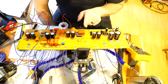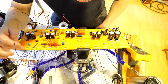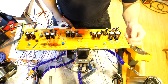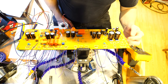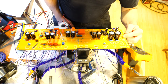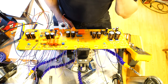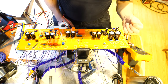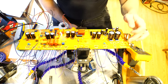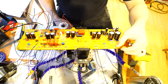This is going to connect to connections on the board. There's a wire for the global negative feedback, an output center tap that connects into that, and the phase inverter ground which connects to chassis. One of the other grounds - I think this one - will connect directly to chassis and provides all the ground for the pots and whatnot. Down here I've got standby switch, choke, and then I hook my filaments up - the first three and second three are all coupled so you connect one half of each of the filament transformer windings. I'll also have the high voltage and bias, snipping the spade connector leads and soldering them in. I'm going to read through the build notes and figure those parts out.